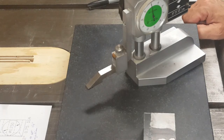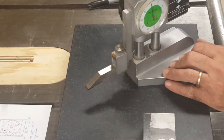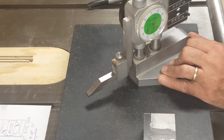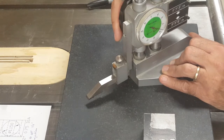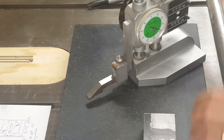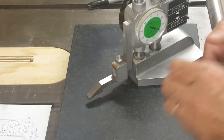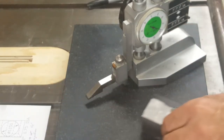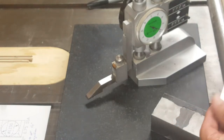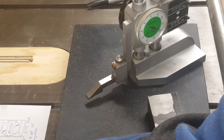And let's see, what else do I need? I need these two holes 7/8 of an inch apart. They have to be 7/16 in from each side. That's 0.4375. Back down. That's 0.4375. I'll just double check that I actually have the correct distance between these holes. It should be 7/8 of an inch, and it is, quite nicely. So I have these two hole center marks, and I have this hole center marked.